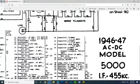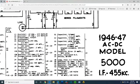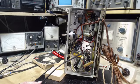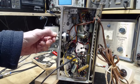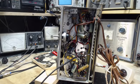Number 15, the resistor, is 220K half watt. So that would be red, red, yellow, I believe. So look for red, red, yellow near that tube. Okay. Red, red, yellow. First of all, because I turned the sound down, I'm at risk of being electrocuted, so I'm going to turn off the power.